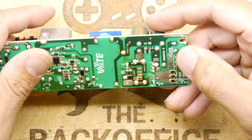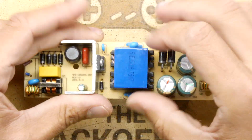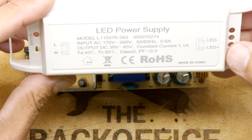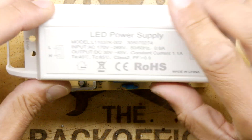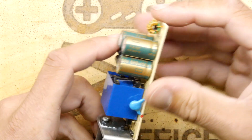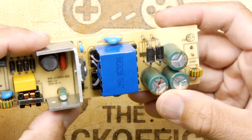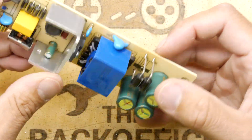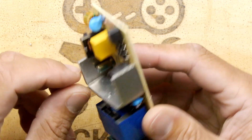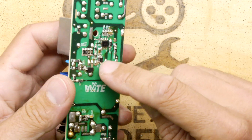It's got its own little regulation and things to operate. The idea being, if you have more load on this side then the power supply can react and make sure it's supplying the correct amount. LEDs do need this - you can see here: constant current. So I think the only thing I can do, looking at these capacitors at 680 microfarads, is probably think about changing capacitors. I'll probably change this one first because it's on the side controlling the output, and as we know the output is flickering - it could be just this starting to break down.